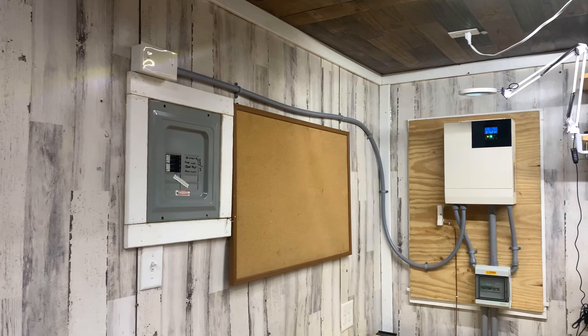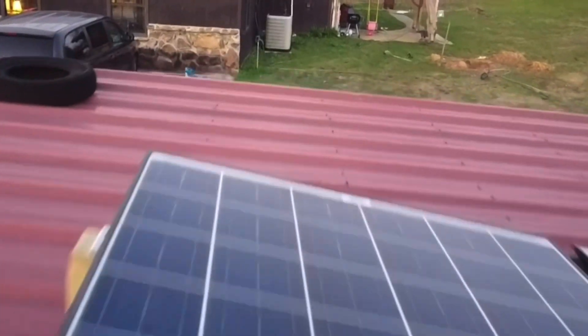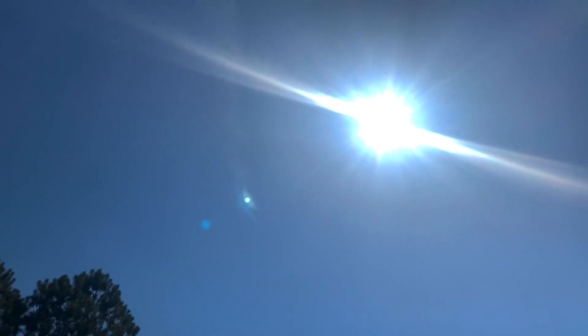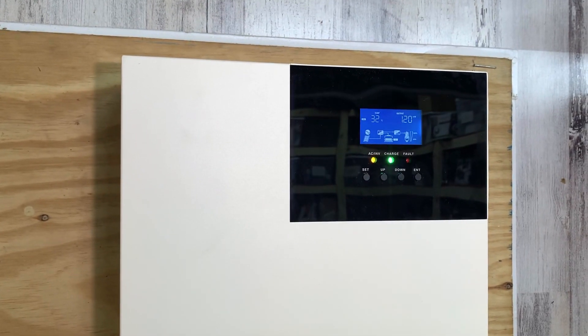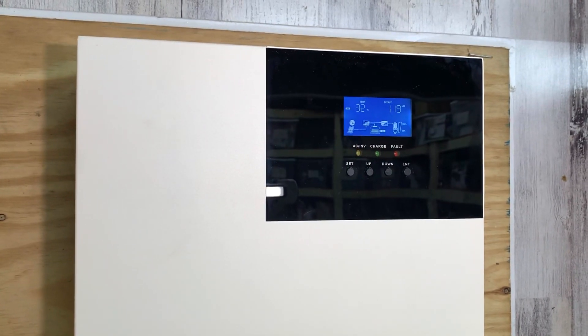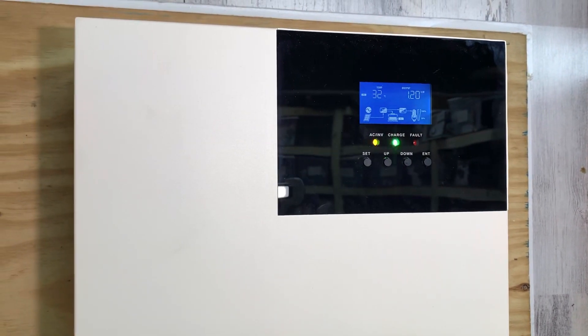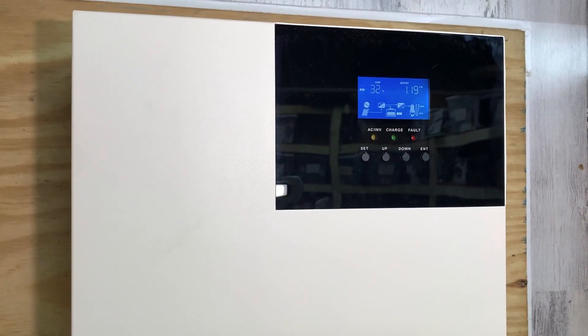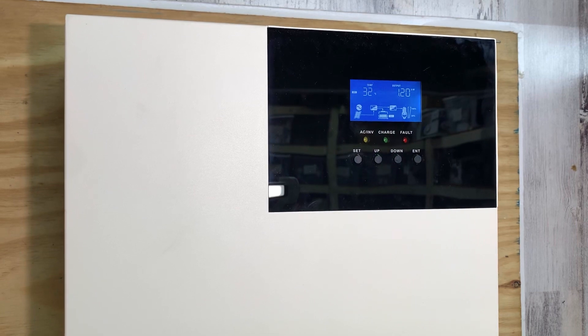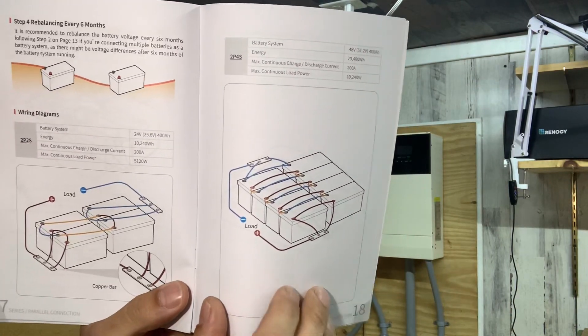The AC output feeds over into this breaker box. It's about 12 o'clock in the afternoon — perfect time to see what my max solar potential is right now — and it's looking at about 1,200 watts, so 1.2 kilowatts out of a 1.5 kilowatt array. That's how I did my system. I'll leave some links in the description for any of the products I used. And if you were wondering why I wired my batteries the way I did, on the back of the battery it has diagrams on how you should wire your batteries, and since I'm doing 48 volt, this is what they suggest.